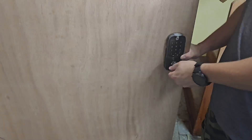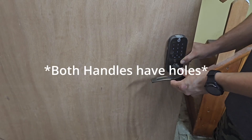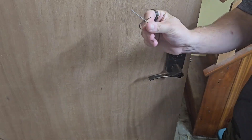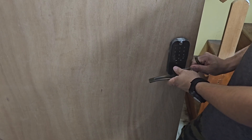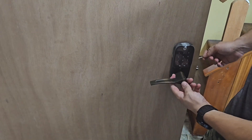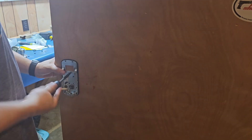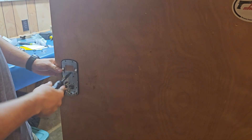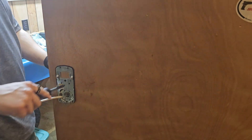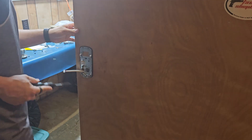I'm putting this on backwards — why weren't you guys going to tell me that? We're going to stick the key cylinder in. We're going to get the handle with the hole in it, not the one that doesn't have a hole, and it actually comes with this little tool. This is the handle tool — it's just a little pin. You can use a screwdriver if you lose it. Something I've learned from putting a lot of these locks in is it's best to use as minimal power tools as possible, because that's when you'll start binding wires up and motors.